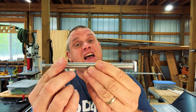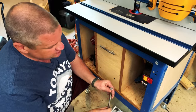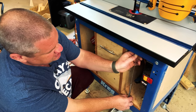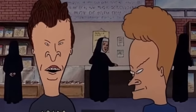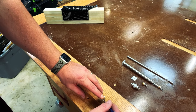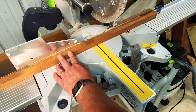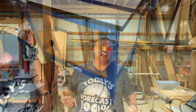These measuring sticks are basically an adjustable story pole. This allows you to use your workpiece as a reference versus using a tape measure. Let's take a look at those attachments. With the flat end cap attachment, let's say I want to figure out the difference between the top and bottom of this router cabinet. All I need to do is take my extendable measuring stick and place it in between those two items, then remove it and mark my wood. By resting the stick on the piece I want to cut with the end flush, I can strike my line and then go to the miter saw and make my cut. And just like that, I have a piece that perfectly fits inside that gap.